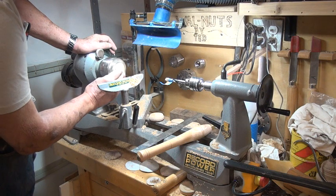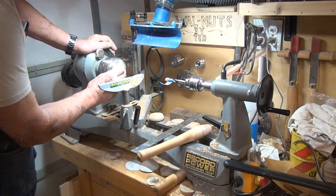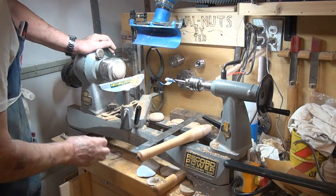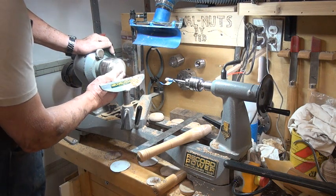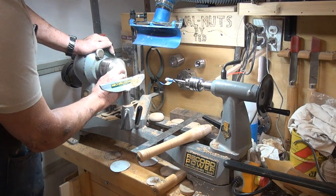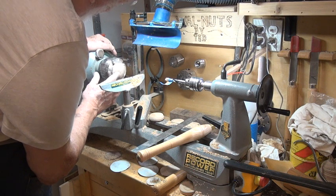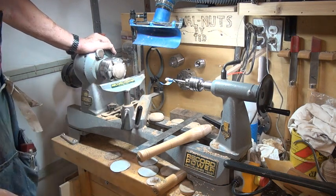Starts in with a 180. Kiss with a 400, just to make it kind of shiny, nice and smooth. I may not like what the middle looks like yet, so we'll see. Needs a little bit more. Anyway, that's what I'm going to be doing. Do the other one, then do it three more times, and then...